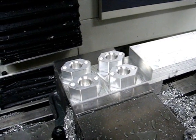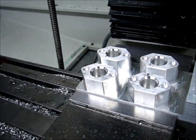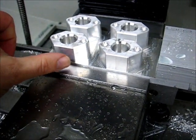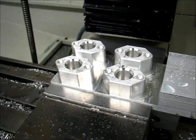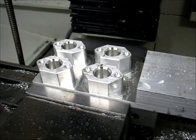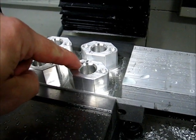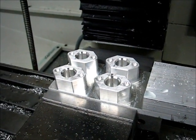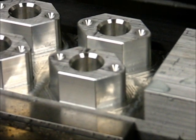Alright, my battery is almost dead, but here's what we got. The finishing operations around the outside indicate that I've got some slop in my adjustment — there's a little bit of a step on each one of them, it's pretty significant. So I've got some more adjusting on the gibs to do. When I spot drilled these with the chamfering tool I thought it was going to turn out like crap — it turned out to be absolutely brilliant.